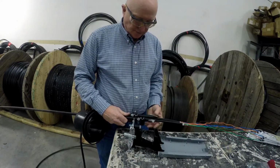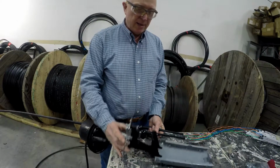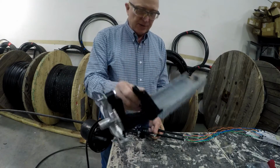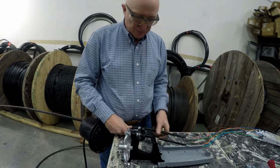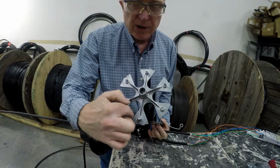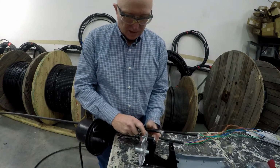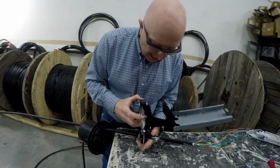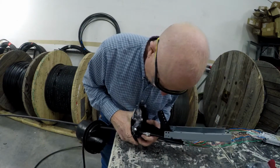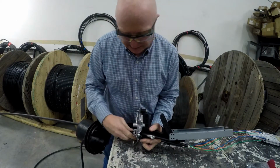You have your 2 cables. You have your tray that has this star chamber where your fibers are going to come through and enter into the tray. Okay. On this, you're going to put 1 fiber through this bottom one, 1 fiber on the other side through this bottom one. And the way to do that is to slide that collar up in there until it clicks down. There's 2 little, you hear that click, that's locked in there now.